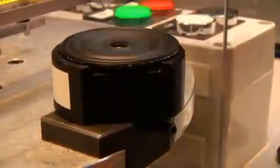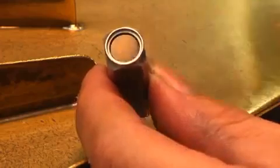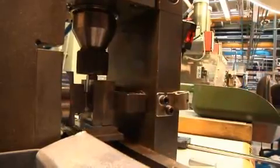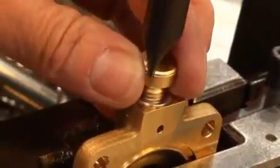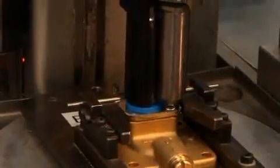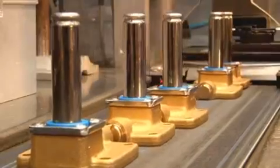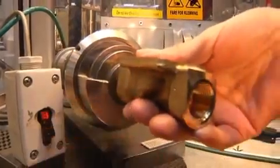The diaphragm parts are flanged together. The seat plate is mounted in the armature and the production number is stamped on it. The equalizing orifice and the armature system are mounted on the valve cover. The pilot filter, diaphragm and spring are mounted in the valve cover.